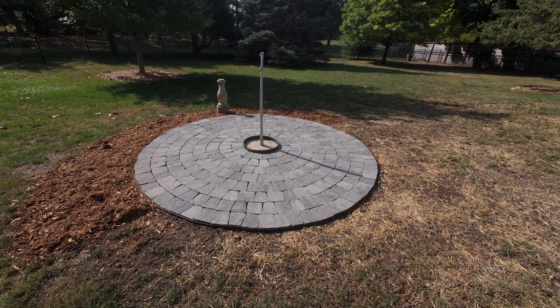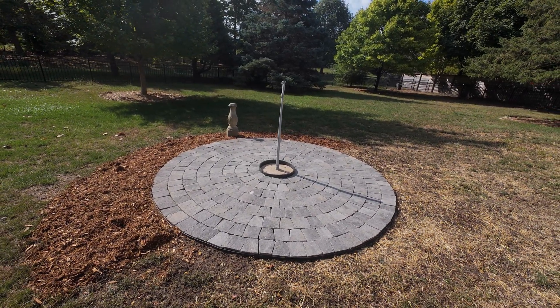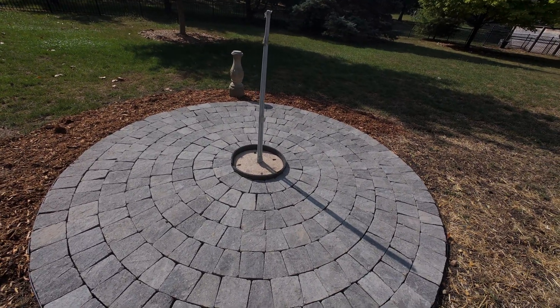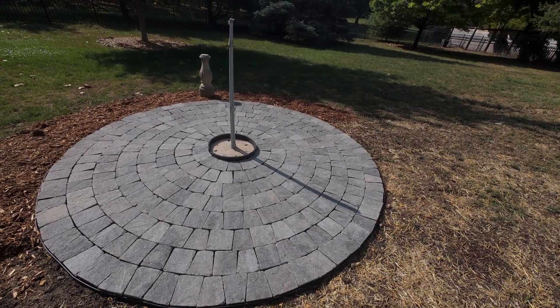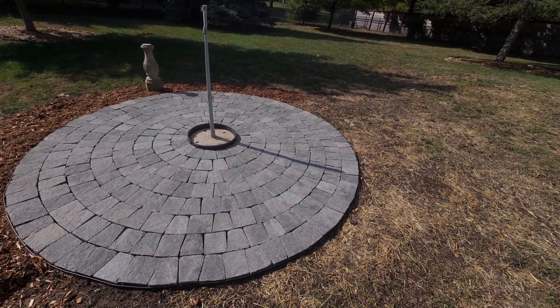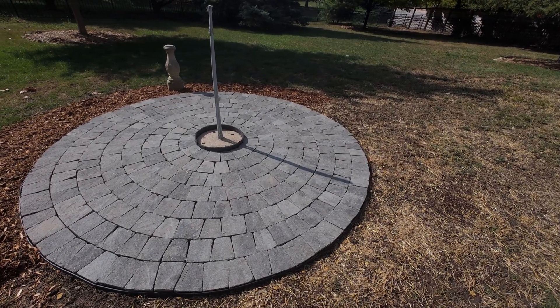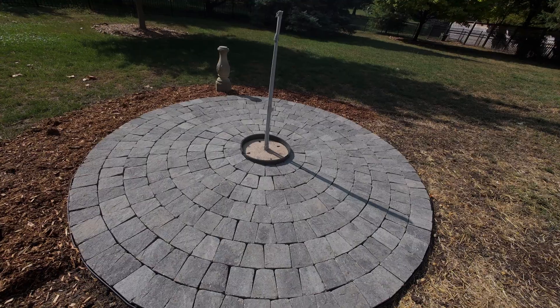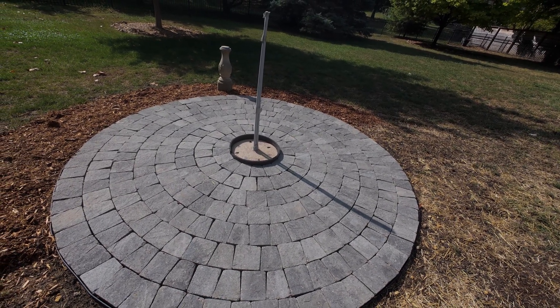All of that work has led up to this. I just wanted to show you where I'm at now. I've got a couple things left to do. Today it has been rainy, although it's sunny right now — I'm waiting for things to dry out. This is the new pier pad. Obviously I don't have the pier in yet — that's going to be coming in an upcoming video. What I do have is the pad itself, and as you saw, we have the pier in the middle. I have the expansion joint in here high right now because I'm going to be putting in polymeric sand, which fills all the joints of the pad. I add a little bit of water to that once I get all the sand in there and it'll harden into a cement-like hard grout for all of these paver joints. I'm leaving the expansion joint high to help keep the polymeric sand from getting over into the top of the pier.